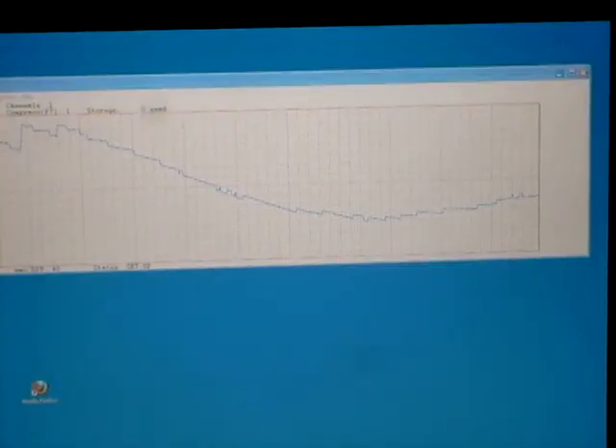Here's a sample of a data log. I've artificially set the nominal pulse width to the clock to be very high — 25 milliseconds; more typically it'll run at about 18 milliseconds — to give a step response I can study and adjust the algorithm. What you see is the clock starting up and running very fast, running too fast, and then the control algorithm gradually slows down the pulse width. You can see it overshoots just a little bit, then comes back up to the nominal pulse width needed to keep the clock accurate. This data logging is very useful for developing and tuning the control algorithm.